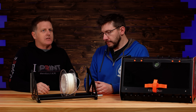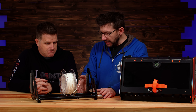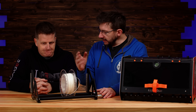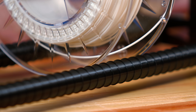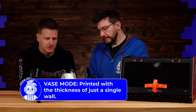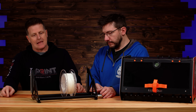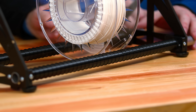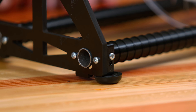It's a no-look, load-and-go system. It's not bearing smooth, but there's enough slip for a 3D printer to grab the filament. Our testing procedure was: can an Ender 3 or similar extruder pull it with minimal effort? We have a little ribbing here just to keep it from wandering left to right. The PETG is nice and slick, and everything rolls with the layer lines. These are done in vase mode as a parametric model, so if somebody wants a different ribbing configuration or different length, you just print them in segments and they thread onto the pipe.